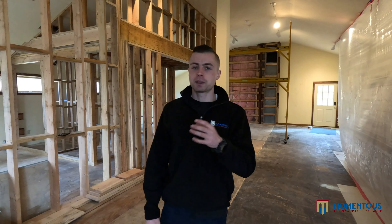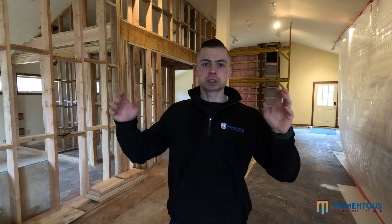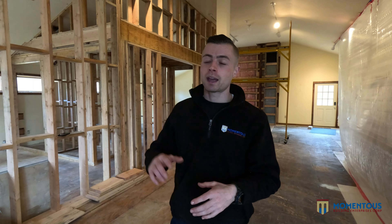If you look at last week's video versus this week's, it might not seem like there's been much progress in the framing — it doesn't look like two or three guys were here all week on woodworking, securing blocking, and things like that. But there's an interesting condition with wood framing and steel framing: the idea of just throwing up walls and then finishing the actual work. In commercial construction, this is commonly referred to as Hollywood framing — you throw up the walls to make it look done like a Hollywood set, but you still have to screw it in and brace it.